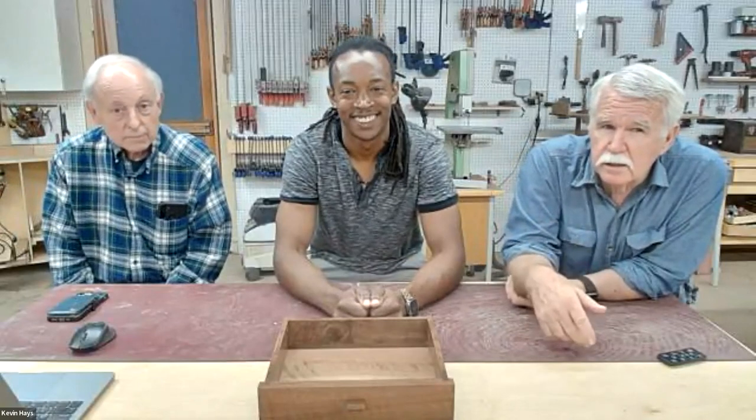Steve, you're shaking your head. I studied with a guy named Brian Miller, who's like the finishing guy in Southern California. And he's like, just don't do it. It runs too much of a risk. Don't use oil, period, on the inside of a box, cabinet, anything like that, because it can eventually go bad. I have some furniture my dad made just prior to World War II, and it smells to high heaven on the inside. We've had to go through it and try to pull stuff off and seal it up. Personally, again, I'm the fourth guy who's just making stuff up here. I just don't do it.